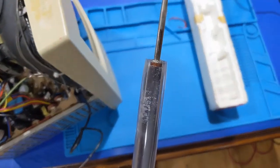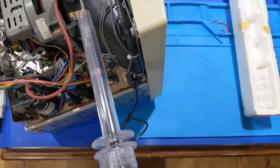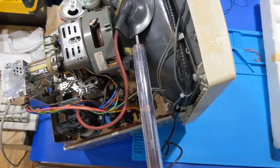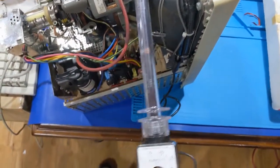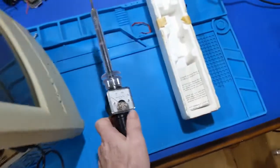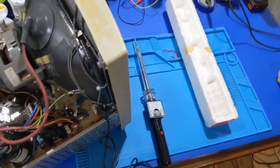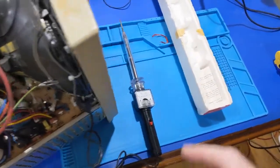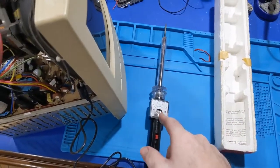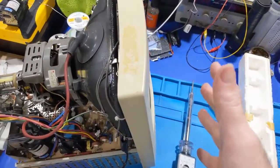So, yeah, the insulation on that might not be very good. But it doesn't concern me at all. It's very, very close to ground. So I need a better way to, yeah, anyways. You saw, we got just shy over 20 kilovolts, which actually is normal. That's what I expected it to be, roughly around 20 kilovolts. So we know where we got to be with that. And we noticed we didn't get a strong electric discharge like we did with the other board.